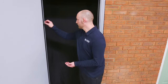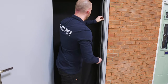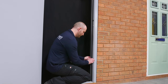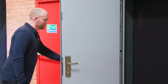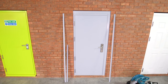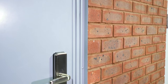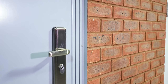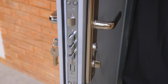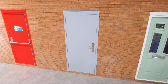As a finishing touch, reopen the door and insert the metal dog bolt caps into the appropriate fixing holes and fill the remaining holes with the plastic grommets. Carry out a final check to ensure the door latches correctly. Our security trim kit is recommended with all security installations to protect the fixings from attack, and also as a quick and easy way to finish your door. See our how-to fit your security trim kit video for installation instructions. To view our full range of steel security doors, locks and accessories, please visit our website.